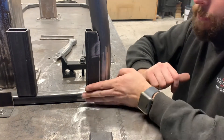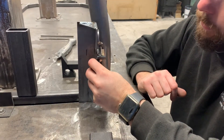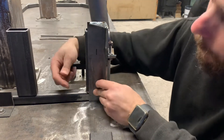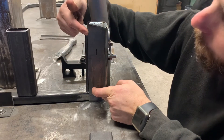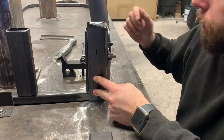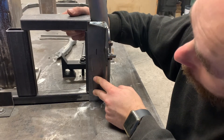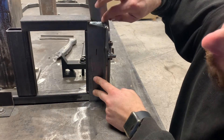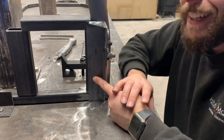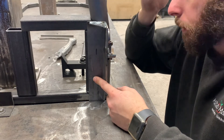Once this is fully welded - loads of penetration in there because it's a nice groove - that'll sit back flat, and then our arm instead of being out in the middle of nowhere can come right over and sit on that box. We'll get a full weld all the way up inside this box tying it to the main cage. Once the top's on - one inch by one inch - we can get a weld across the top, so it's going to be fully welded all the way around. This thing ain't going anywhere.